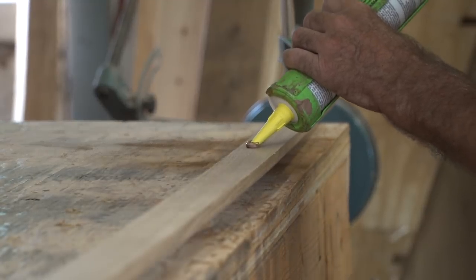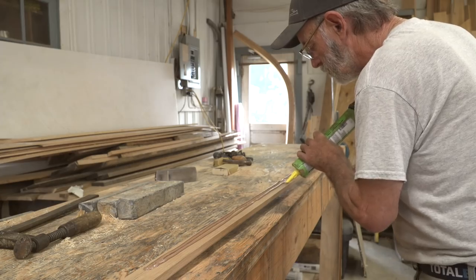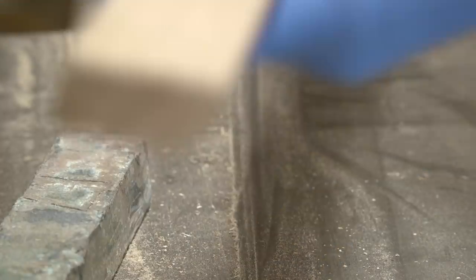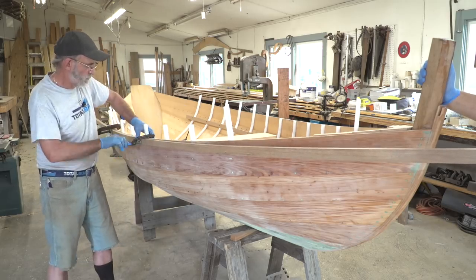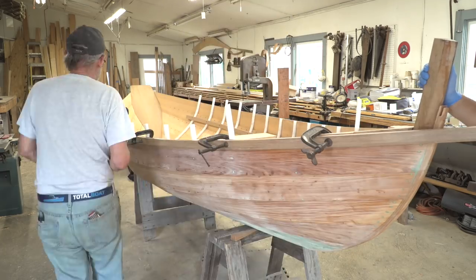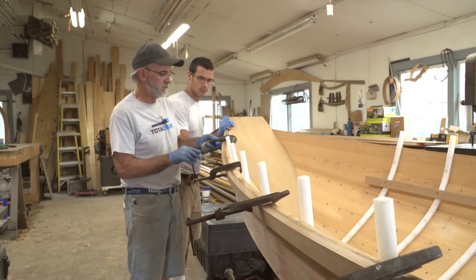We're getting ready to bed the rail into position and I'm applying polysulfide to the backside of it. Just a couple of beads does the trick and it squeezes out pretty easily as long as you get to it quickly. Polysulfide goes off with humidity, so if it's a damp day it goes off a little bit faster. I'm using polysulfide because I only really want to bed this rail in place — if you ever wanted to remove it and it was epoxied down, you'd have an awful time. So even though it's fastened from the inside, you can remove the in-wale and back out the screws to get this rail off the boat.